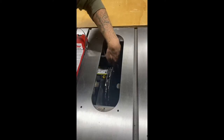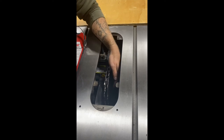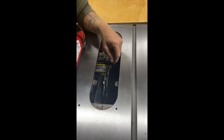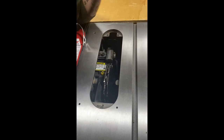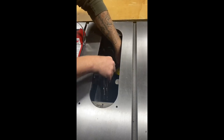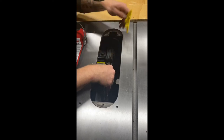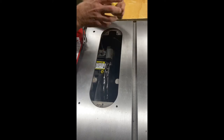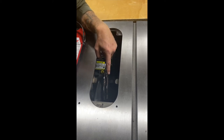I've got my 8-inch brake in here, I've got my key inserted in the back, I've got my 3/4-inch dado blade installed, and my nut is on. As you notice, I'm not using the washer that comes with it — SawStop says as long as you have a blade that's over an eighth of an inch thick, you don't need that. Also worth mentioning: make sure you have your riving knife positioned down even though it's not in there. I'm going to check the spacing and spin my blade to make sure we're not touching in the back, or it's barely touching. You can use a nickel or the spacing tool that comes with it — we have the right spacing and everything's good. Also make sure that the carbide teeth on your dado stack are staggered and not touching each other.